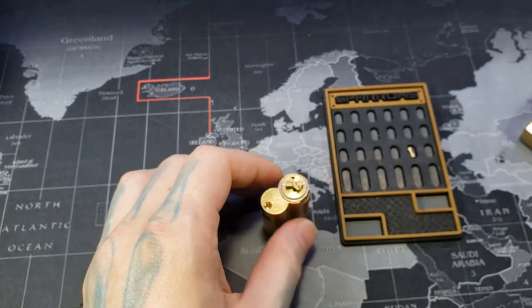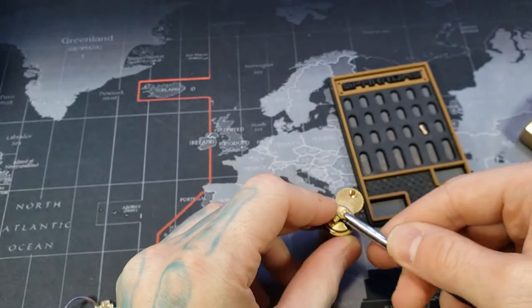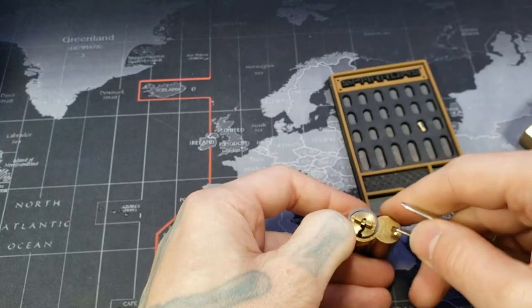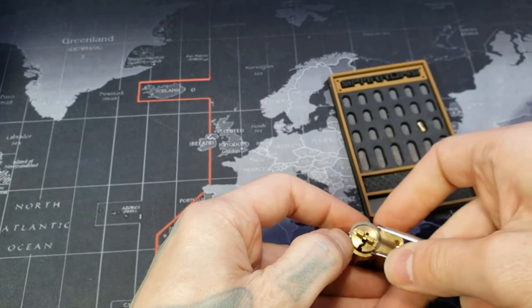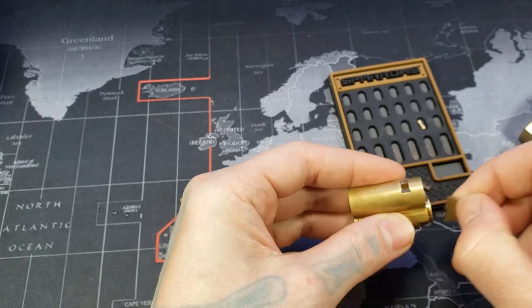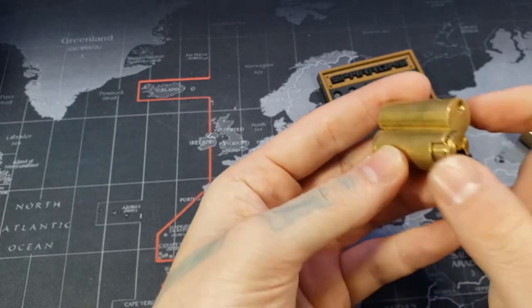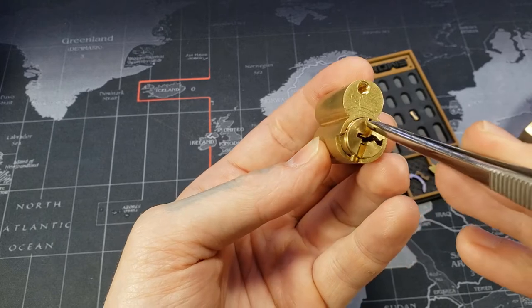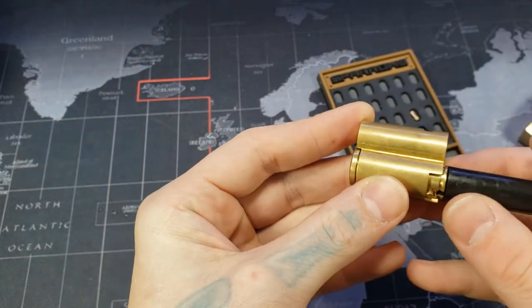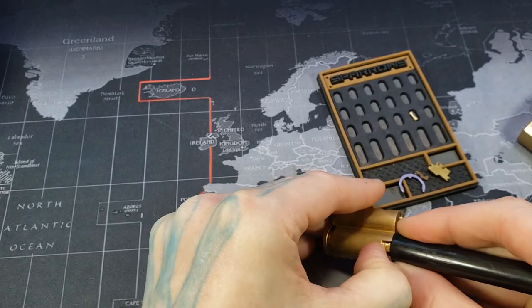Let's go ahead and get this off. There's our Z-bar here. I believe it's this size. I need to make sure that in the back here the driver pins don't fall down in there, so I'm going to rotate it that way just a little bit. And our detent pin right there - we're going to have to push that to get this to come out. Let's do this gently.